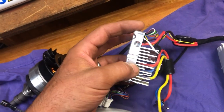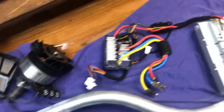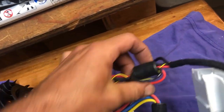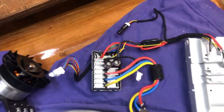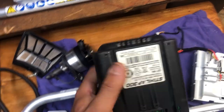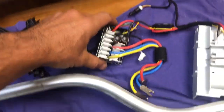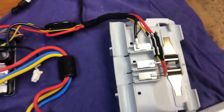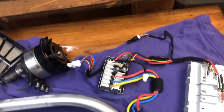I think it draws air across the controller first. This part actually fits right inside the screen filter, and the rest of it — this is canned and potted. All of the connections look really solid. There's a ferrite coil, and there's also a yellow fine-gauge wire back to the battery pack — something that communicates with the battery. I haven't really dug into how these battery packs from Stihl are wired, but their BMS must be inside them. It's probably a battery temp signal — maybe a thermistor or a thermocouple — to give the ESC, give the controller, some feedback on battery temp.